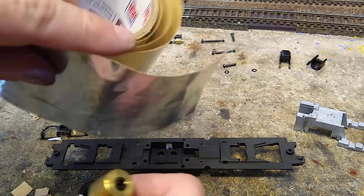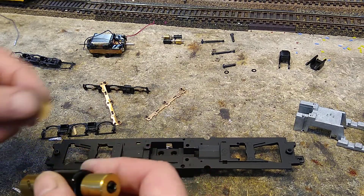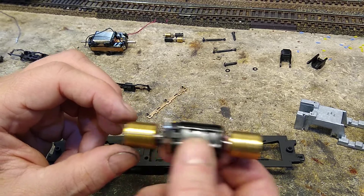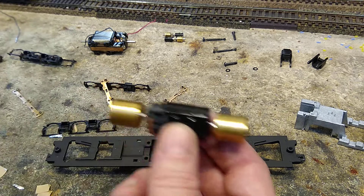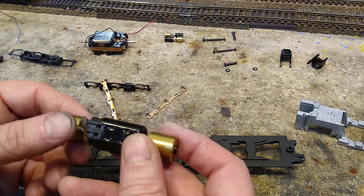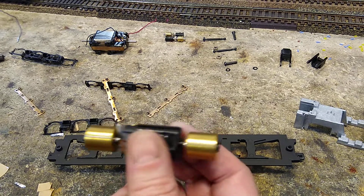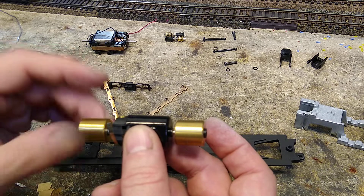What I did was I took this foil tape, cut a little piece off, and I wrapped the shaft with that metal tape. I checked it and checked it until I got a decent fit. To make sure it stays on there and doesn't just spin around — which it'll do right at the moment, but not for long — I used some tacky glue, kind of like a Loctite in here. And that ought to set up nice.